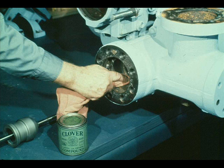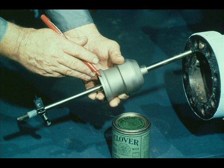Use the same solution to clean the lapping compound from the valve seats. After the lapping compound has been removed, inspect the valve seat to determine the contact. Most plants require nearly perfect contact between the valve and the valve seats. Your instructor will tell you more about the requirements at your plant.